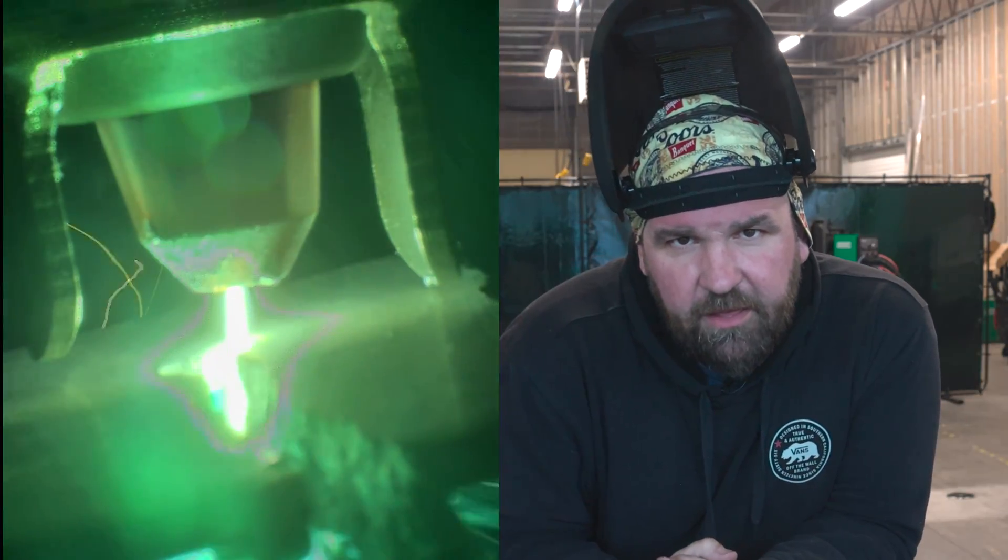That wraps it up on the plasma side of the 220 MTSC. We were cutting some quarter inch — it's max rated at a clean cut of half inch and a severance cut at five-eighths. We weren't really pushing it too hard today, but nice clean cuts, really powerful all-in-one tool. Go back and check out the other videos on this thing for the MIG, AC/DC TIG, and stick — you can see it is a true full-feature multi-process machine and you're not giving up anything on any of the features. Check out the new Hurricane — it's an awesome machine and we will see you guys soon.